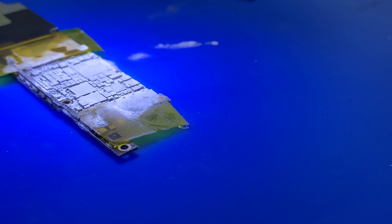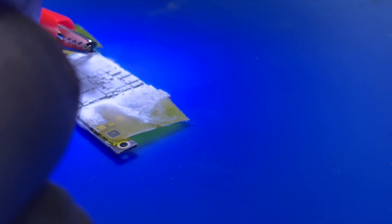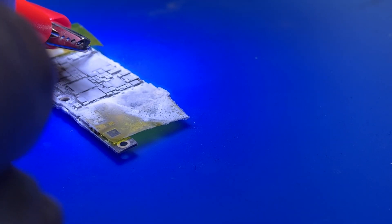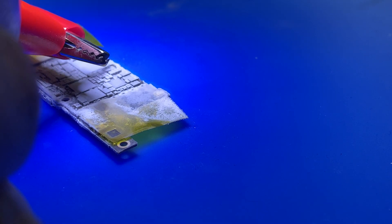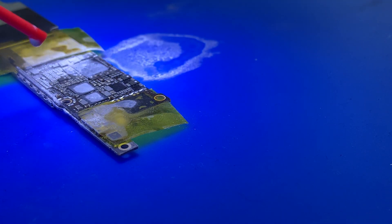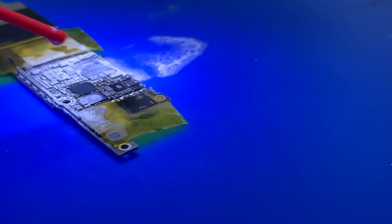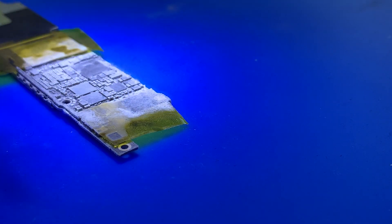We inject it now with the freeze spray. See that right here in that corner? This gets hot because I have high amperage there. Right here at 502 it's getting hot by itself when I'm touching it, but I'm talking about that capacitor in the corner — that's our culprit, that's our issue right there.